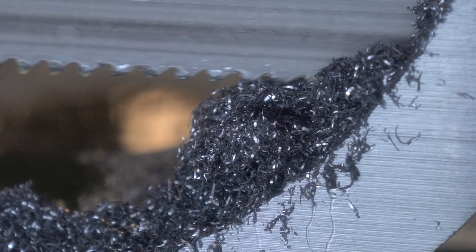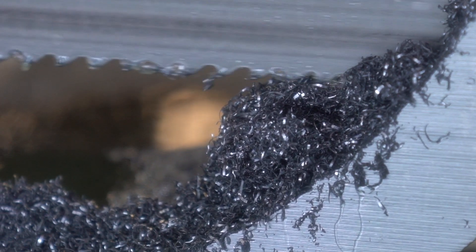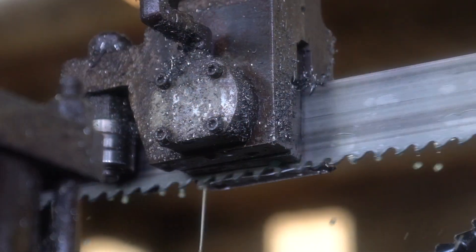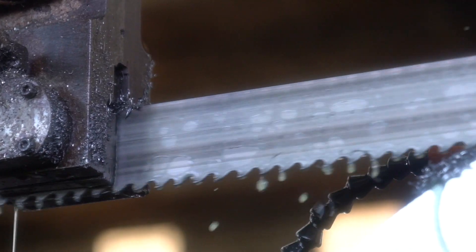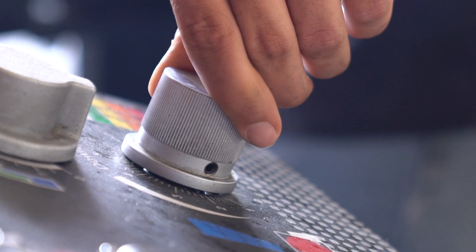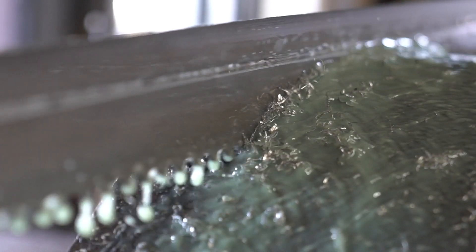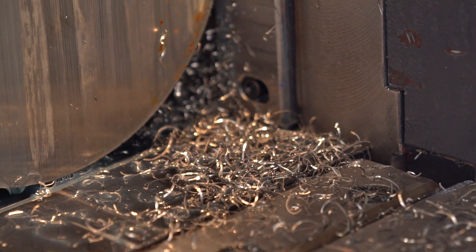The chip is a great indication to tell us how that cut is doing throughout the entirety of the cut process. If you notice that the chip is overheating — if it's turning straw brown or turning blue — you've probably got too much feet per minute on the blade speed, so you want to slow that blade down. If the chips are breaking up, you also probably have too high a blade speed, or if the chips are too tightly wound, you probably have an overfeeding issue.